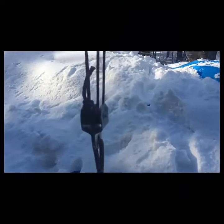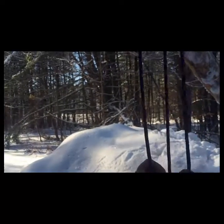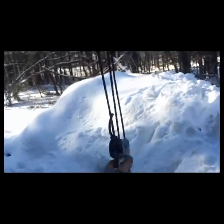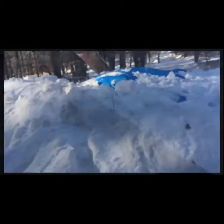So here I've got a double pulley — I guess maybe this would be called block and tackle or something — but it's two pulleys, same thing up there, just got it tied off here. So this is supported by three strands, which means I'll have a mechanical advantage of three, which also means that when I start pulling that rope out, I'm going to go about three times as far as this piece of wood. But I've just got a loop around it.